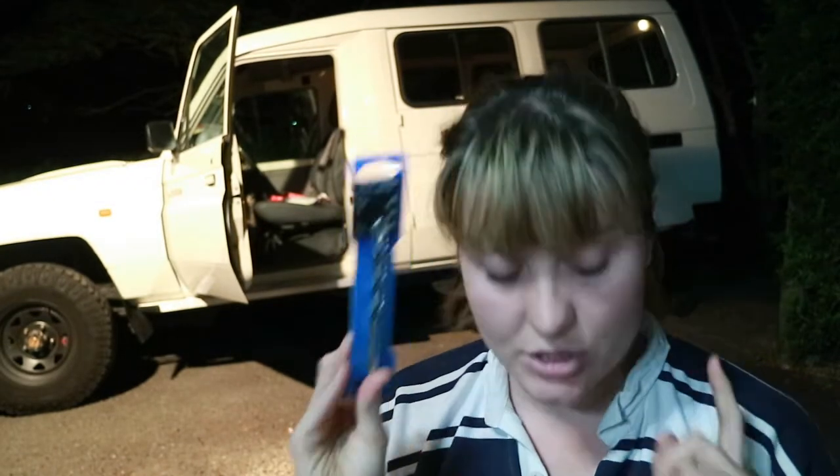So we got this. From what I can tell, you put the rivet into the steel hole and then you use the rivet gun to press it and it slams it together, almost like shrinks it, and then you've got a thread. I got a 9mm drill bit, which is interesting. The bloke explained it to me, has like a bit of edging of the steel, so it'll fit a bit. Got some M6 bolts, countersunk heads, because I want them to be flat.